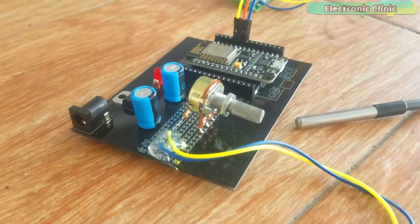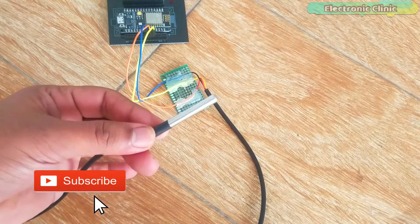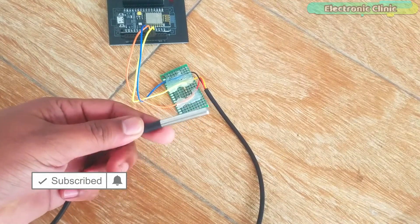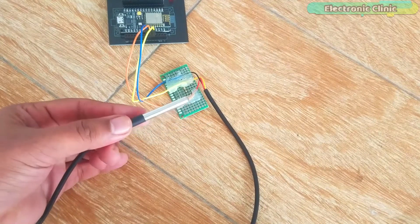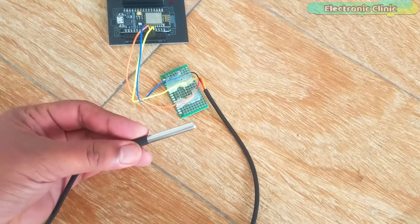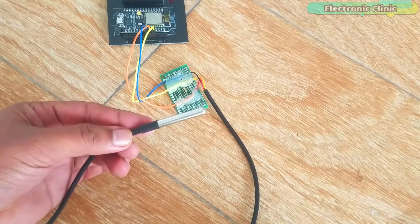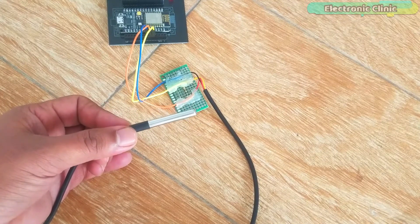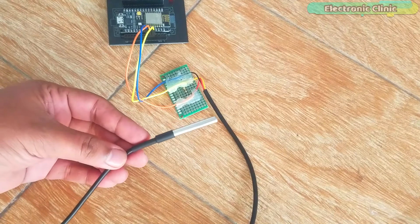The components and tools used in this project can be purchased from Amazon; purchase links are given in the description. One-wire temperature sensors like the DS18B20 are devices that can measure temperature with a minimal amount of hardware and wiring. These sensors use a digital protocol to send accurate temperature readings directly to your development board without the need of an analog-to-digital converter or other extra hardware. You can get one-wire sensors in different form factors like waterproof and high-temperature probes, perfect for sensing temperature in many different projects and applications. Since these sensors use the one-wire protocol, you can have multiple of them connected to the same pin and read all their temperature values independently.